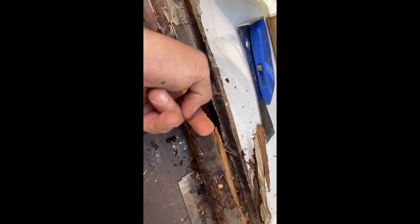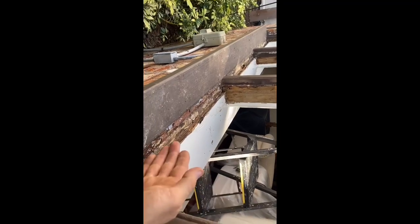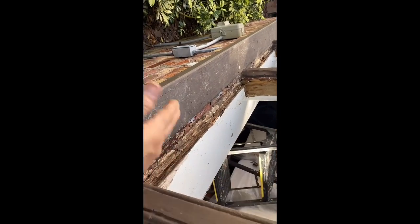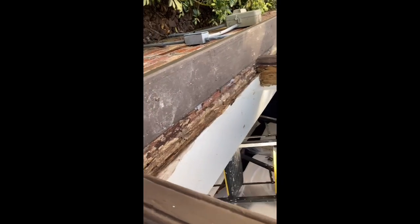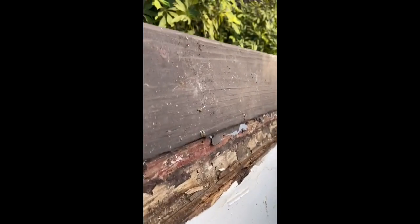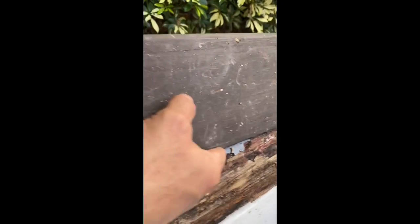Shoot, I might be able to take this, retrim it, and install it up underneath there like it's supposed to be. Because the sash is going to cover, and water is going to hit the sash and run out, and if it slopes uphill, it's harder for the water to run uphill. Anyway, right now the way it's set up, this sill is actually lower than this sill, so you've got a pocket here where water is able to just get in. So we'll see what happens.